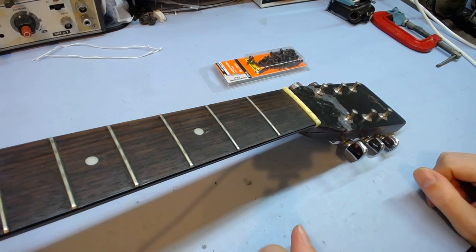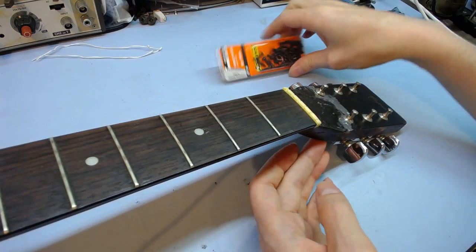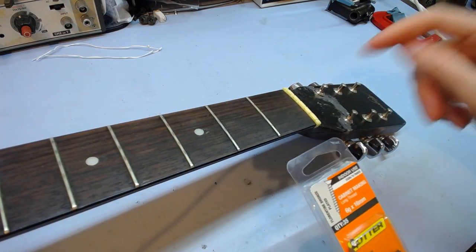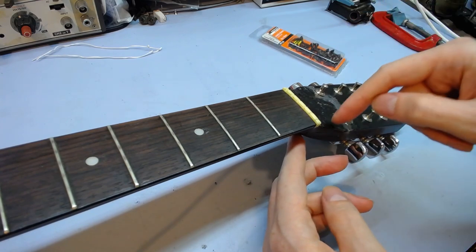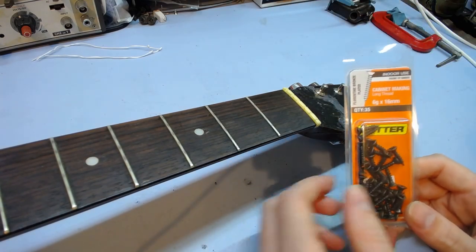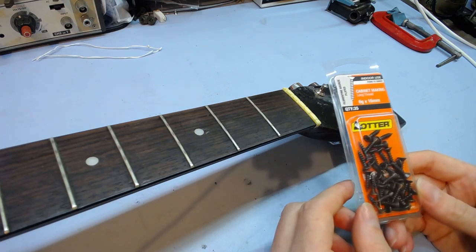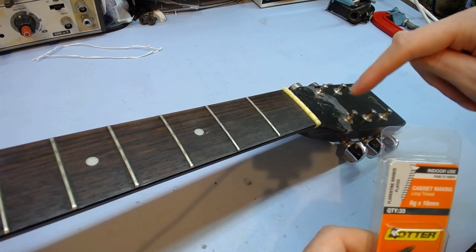Anyway, we'll see. If I do that, the other question, of course, is to get the actual screw straight, because the idea with this is countersink heads. You can countersink these in and it won't look too bad, but obviously if you drill on the wrong angle, then the countersink head won't go in the countersinking hole properly and it will look a bit horrible. So you really need to get that definitely drilling perpendicular, straight down there.